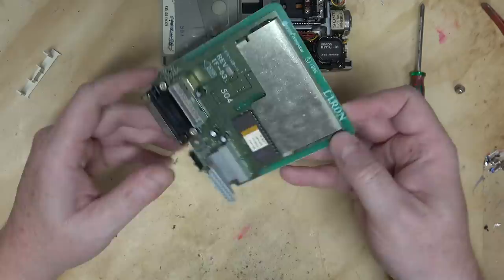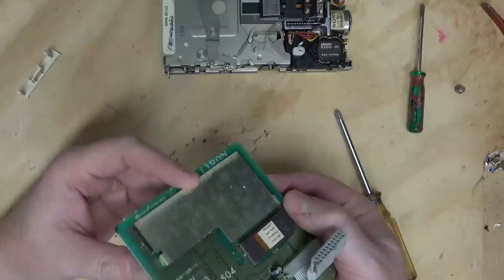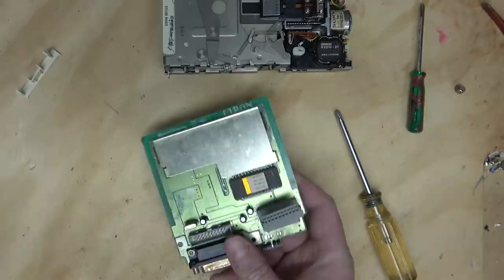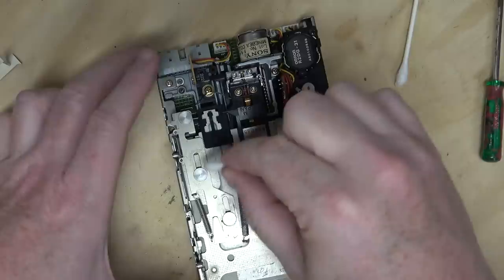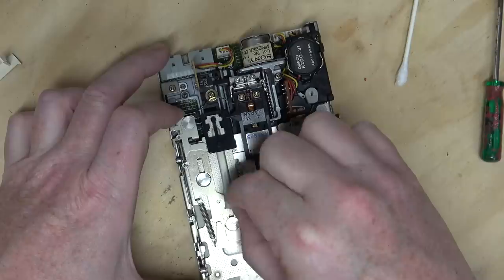It's got an 8K ROM on it. There's a disk drive controller in the back - it has a CPU and two RAM chips and a ROM. This right here is like its own little 8-bit computer just around the disk drive. There was also the issue of the eject motor not fully ejecting the disc - that might have been due to the stickiness. I think right here is probably the biggest culprit: greasy grimy gopher guts.